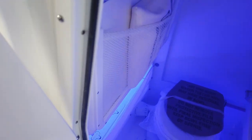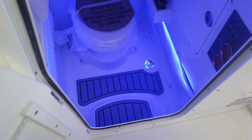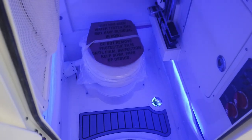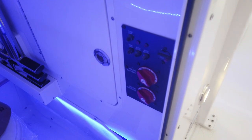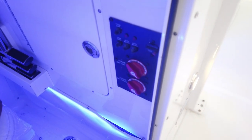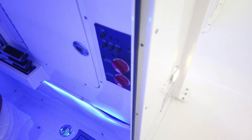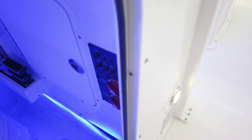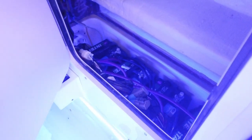Inside the console area and in the head, you've got mood lights as well. They do have SeaDeck matting in the head area. It is a porcelain head with overboard discharge with macerator. You can see the side entry ladder storage, which is an option. Looking at the battery layout — all Sea Hunt Gamefishes for 2024 come with four batteries: two house batteries and two cranking batteries. That's a difference from a lot of other boats, which typically come with three batteries total. Sea Hunt is standard with four, and easy access to the batteries and wiring makes work on the boats a breeze.